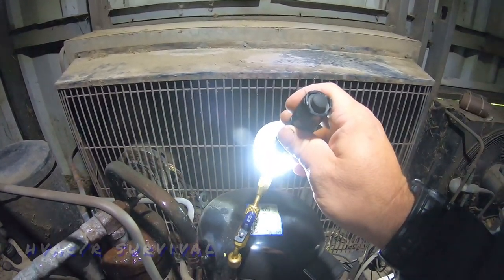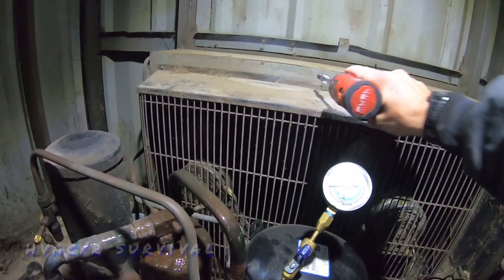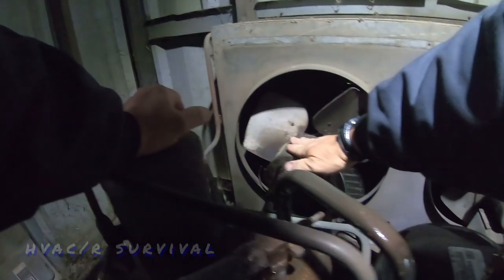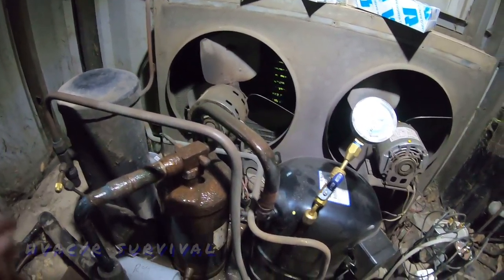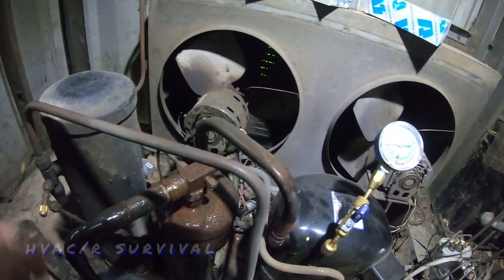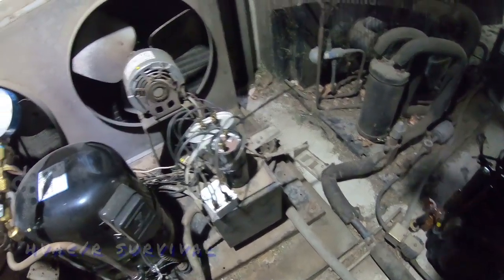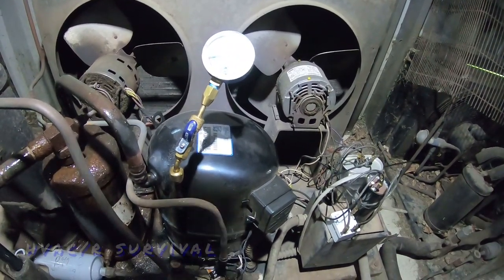So the differential needs adjusted a little more. That motor's hot. You can actually hear it with the motor off — the condenser fan is overheated, it's hot, it's wore out. The low pressure switch is completely out of whack, it's short cycling the compressor off. It's a dual pressure switch — we're going to replace both of them.